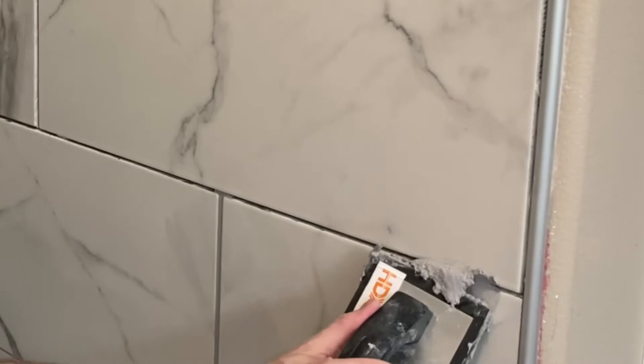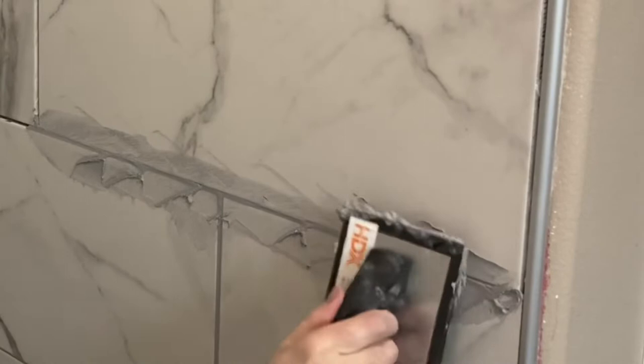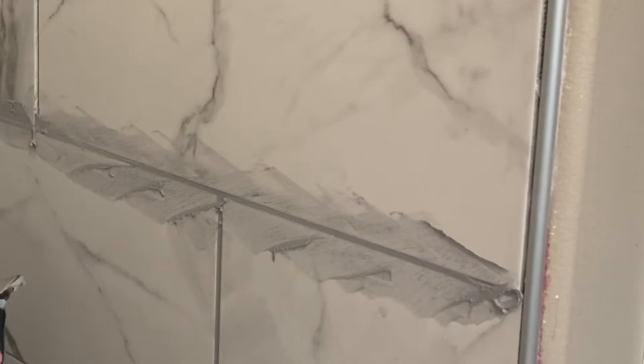Some more views of the application with the sponge, working to get that nice clean finished look. It hardly thickens or hardens up at all — my blood pressure went down considerably once I realized it wasn't setting in five minutes. Obviously if you do want rapid setting — two people working, need foot traffic within three hours — turn the temperature up a little. But if you're a homeowner working solo with time to spare and temperature control, this approach works perfectly.